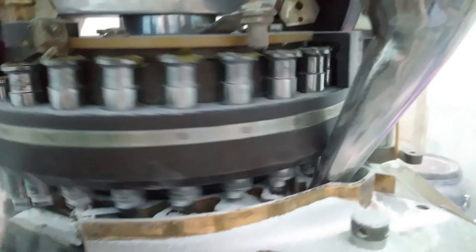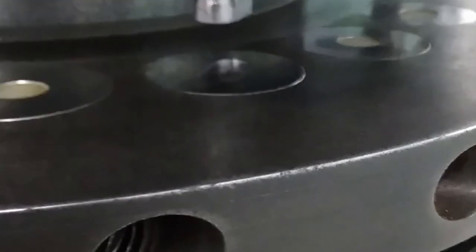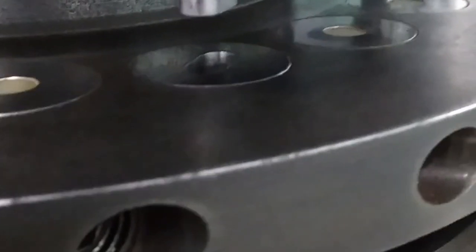Now here is a real machine. The copper-colored attachment is the feed frame, and we can see that the powder is filled in it. In this video, we have removed the feed frame and the hopper so that we can see the inside. If we look carefully, we can see that there is a gap in the die, and below is the lower punch. The powder gets filled in that gap.